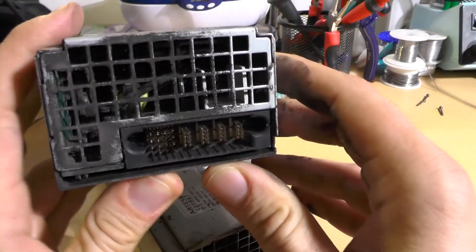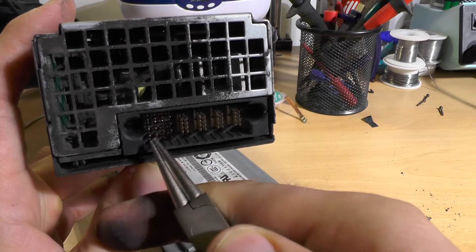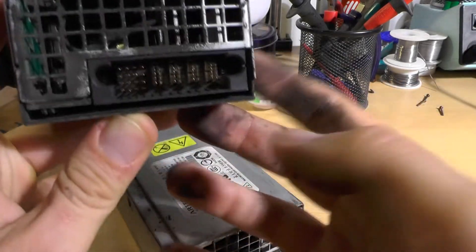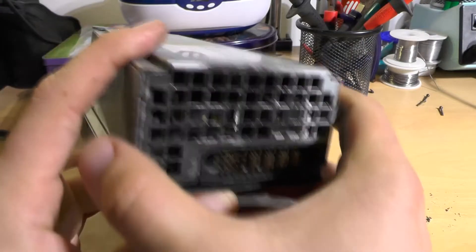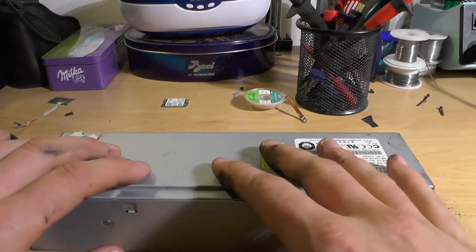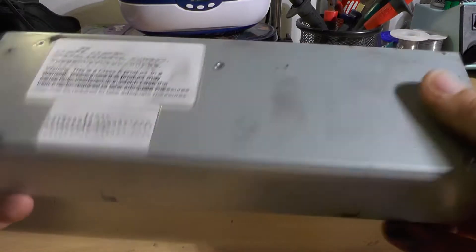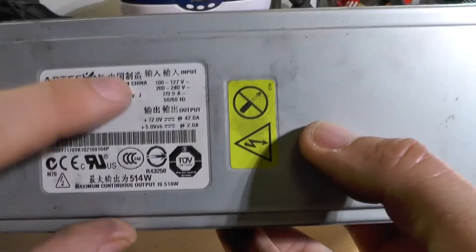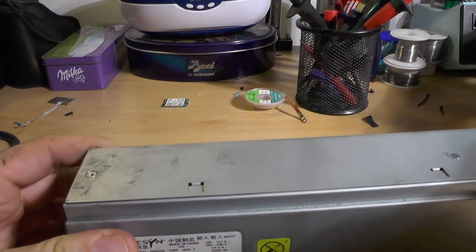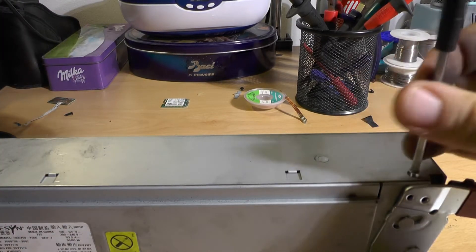For all of you that don't want to watch the video to the end: in order for it to work, you have to connect this wire with this one — you just short-circuit these two and the power supply will turn on, and this will be the output. I will be cleaning this one first because it is very dirty. I've seen some guys with this type of solution just short-circuit it and turn it on, but this thing is actually very powerful — I think it's 42 amps. I won't be short-circuiting it because this thing can cause serious damage and I don't want to set my mining place on fire.